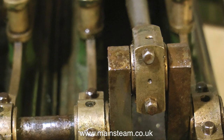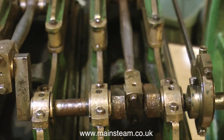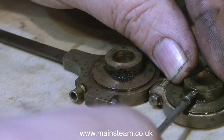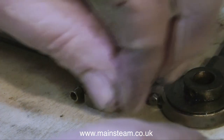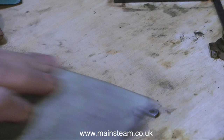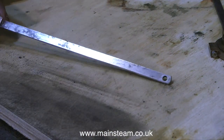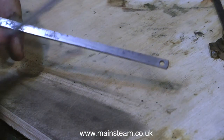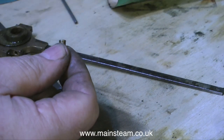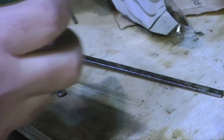Here I'm spraying it with some oil to prevent any further rusting. It really did take me quite a long time to get the crankshaft to look like the picture you've just seen, because it originally looked like this. I'm now going to have a look at the eccentric rods, but the first thing I'm going to do is take out the grub screws from the eccentric sheaves. These will go into the plastic bag marked crankshaft parts. Once again, I'm cleaning up the eccentric rod using some wet-or-dry sandpaper, but I'm getting nowhere fast with this. This is really deep rust — it's just a case of persevering. I've been very careful not to round the edges of the rod. I'll remove these nice little oil cups from the eccentrics — I wouldn't like them to get lost — and I'll put them in the same bag as the crankshaft parts.